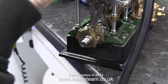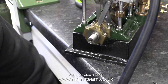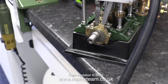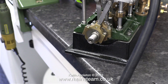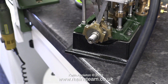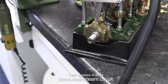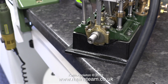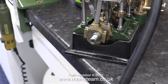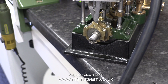Eventually I got one side right. Not very smooth, but do bear in mind this is the high pressure cylinder dragging two other cylinders with the associated valve gear. At this stage I have some good news and some bad news. With the engine running as you've just seen, the eccentric setting relative to the crank pin was at about 90 degrees. Unfortunately though, when I wind the reversing handle and move the expansion link to the other end, the timing is not right at all and the engine will not run in the other direction. If I adjust the position of the eccentric sheave to suit this direction of running then yes it does go in reverse, but then it won't go forward.